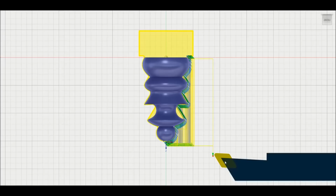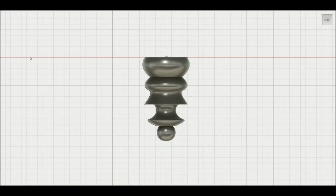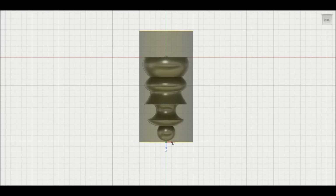Now, if you're using Fusion 360, the easiest way to do this is to simply duplicate the setup for the turning tool. When you're using a second tool on the opposite side of the vise, you'll duplicate the setup. Once it's duplicated, you want to edit the setup itself, and set your WCS, your work coordinate offset, to the offset you used for that second tool. And that, as well as flipping the X-axis, is what you will want to do.